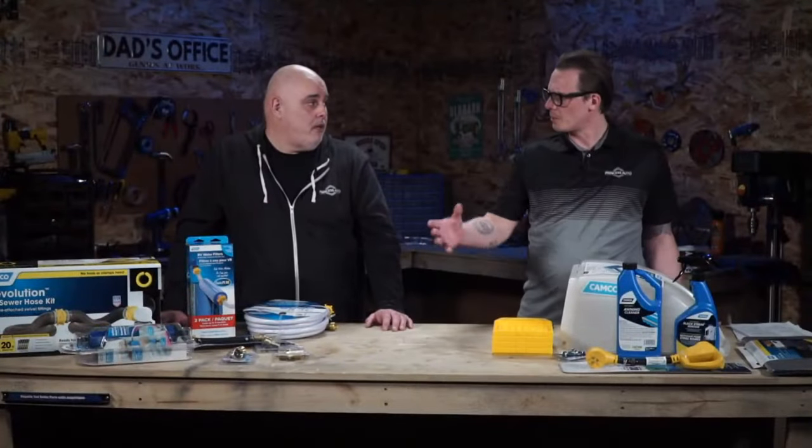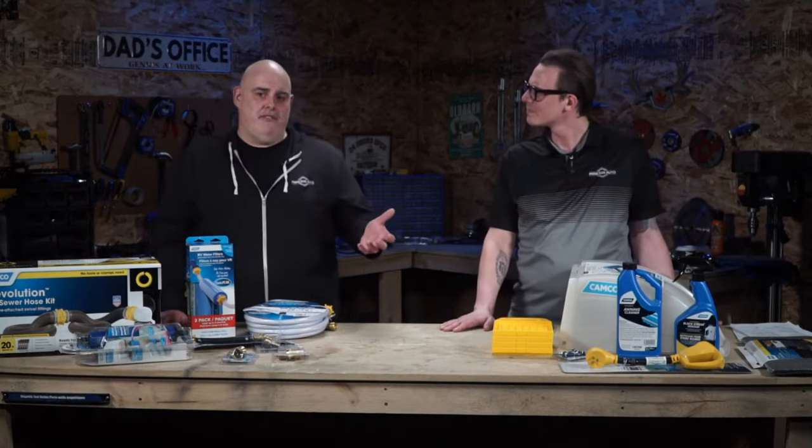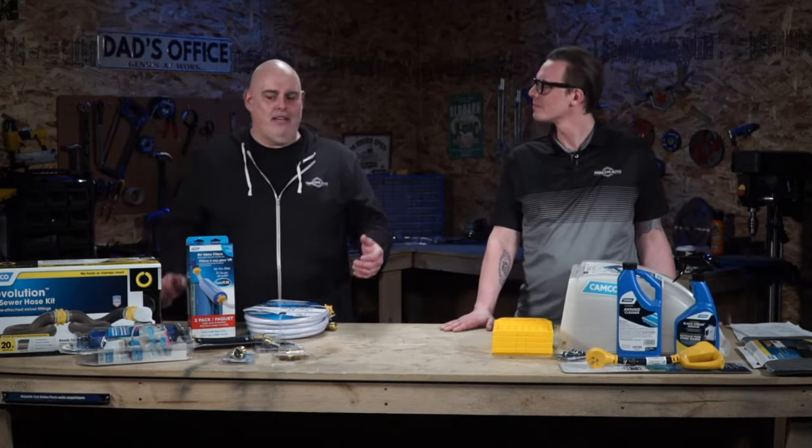I mean, 20 pounds doesn't sound like a lot of extra pressure, but on top of the 40 or 50 already delivered, it can be a little bit stressful on some of the components in there. Is that roughly about the water pressure at your house on the spigot outside? It depends on whether you're on city water or on a well. Depending on where you're at, 70 pounds can be reached in some city systems. Typically a little bit lower, but you're in that range.